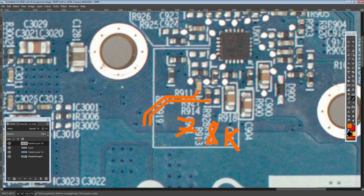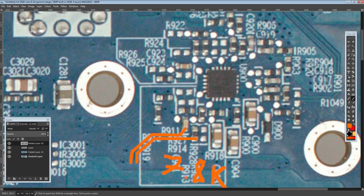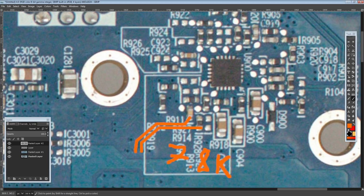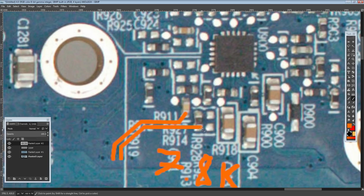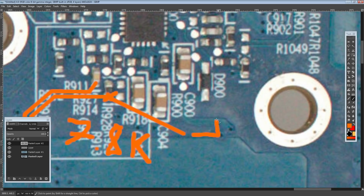So at this point, I pulled out the oscilloscope, and actually, before I realized what I was looking for exactly, I stabbed every single probe point around here. But eventually, I went back to the multimeter and realized that, hey, this resistor is really suspicious. And with the oscilloscope, I checked this side of the resistor over there, and what would you know? That side of the resistor has our square wave from the running of the VRM on it. So that right there.